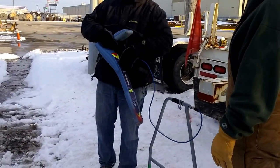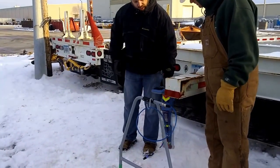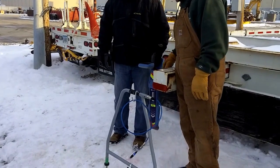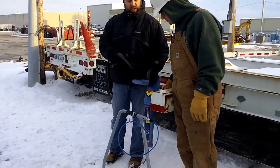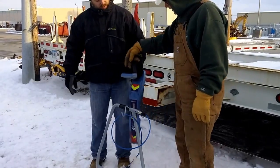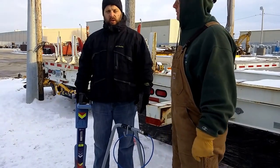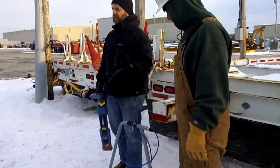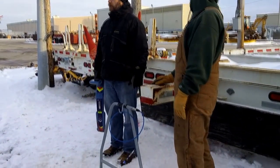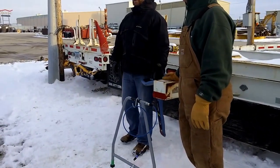After you've found the fault, you can go ahead and locate it. It's right there and it's measuring two feet one inch deep, so you know right where to dig and how deep it is. He went into regular 8 kilohertz mode. Since we're using 8 kilohertz for fault locating, 8 kilohertz can also be used for line locating. It's a little wobbly but it will still give you a signal and a depth reading — that depth reading is always there and once you get close the depth will show up automatically. We had a 70-some decibel reading at the fault. When we originally measured back at the ground rod it was around 90 decibels. The end of this cable is probably faulted a little bit too, giving a slight decibel reading at the end. Always make sure the ends of the cables are up in open air — isolate both ends so you can find the fault.